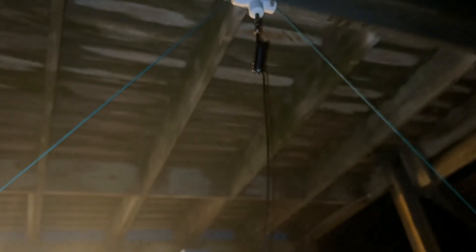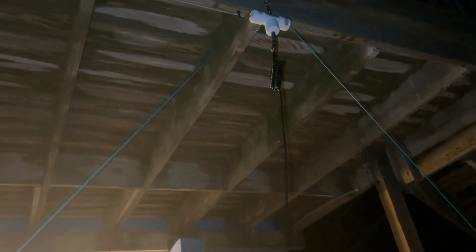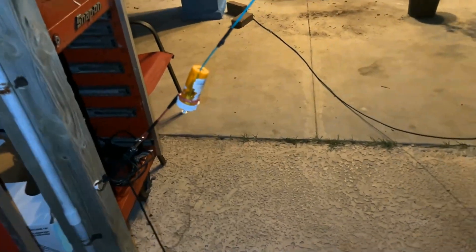And first try — this is the first time I wrapped it — I hooked it up and got a 1.01 to 1. Whenever I put this dipole over on the gazebo, instead of staying at 1.01 to 1, it shifts slightly, and then I can use my SWR screw right here and get it back down to 1.01 to 1.